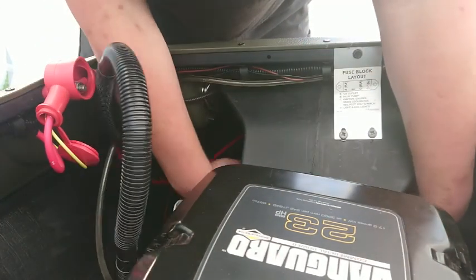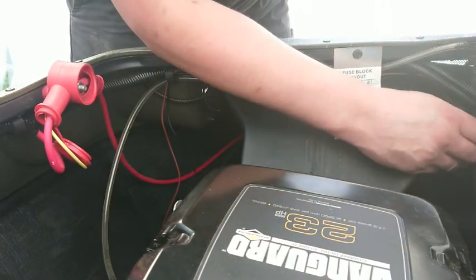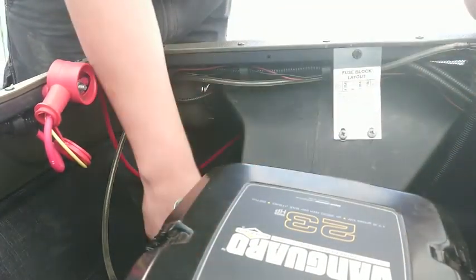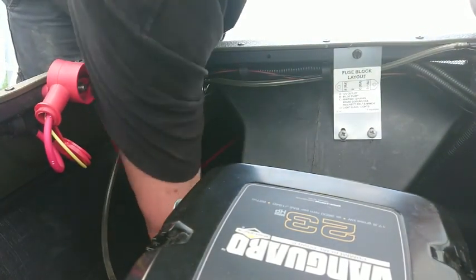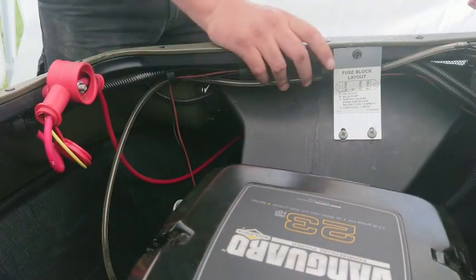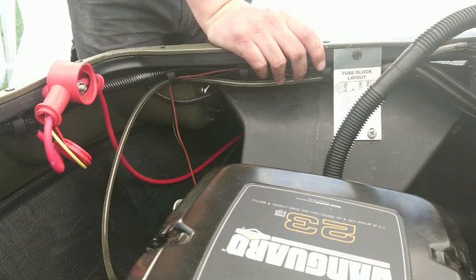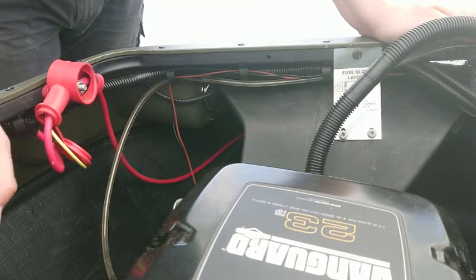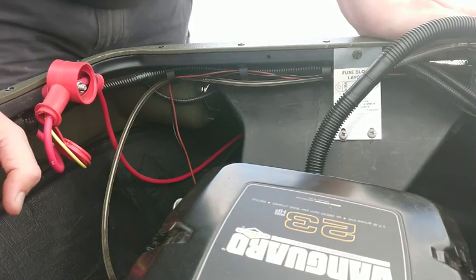I elected to go out the driver's side for an important reason - it's easier for me to see whether the bilge pump is actually pumping water or not. It also keeps this plastic tube away from the exhaust heat shield. That pump fits fairly nicely in there and we've got extra tube so I can probably trim off the length we don't need. I'm going to tuck that in here out of the way while I figure out how to get that pump secured down there - no idea how I'm going to do that yet, and it's a really hard spot to film.